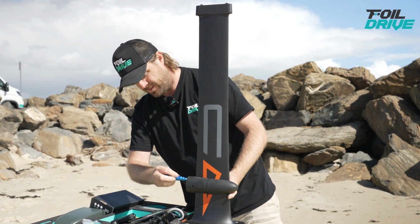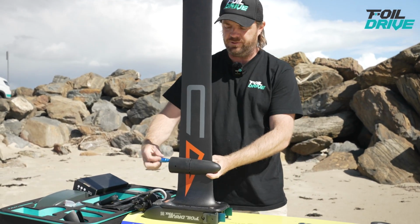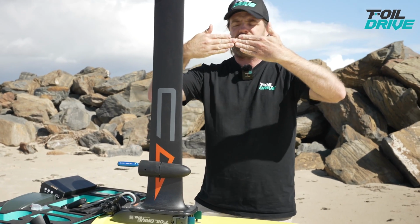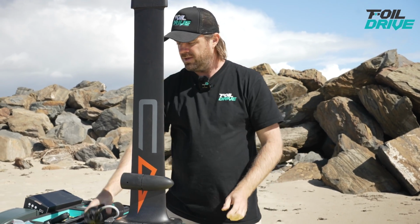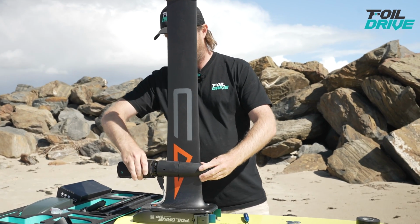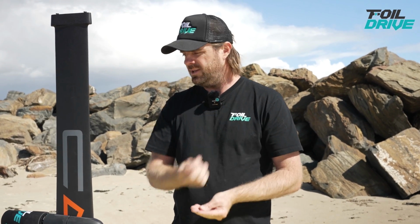So I've now done those up. And the gap looks, yep, nice and even. You just wouldn't want the pod looking like this. You want it nice and straight. Again, just finger tight for those bolts. You don't need to be heavy on it, just finger tight. Pod, I'm going to slide it in, make sure it still fits. Beautiful. So now we've got that on, there's 3 more M3x12 bolts.